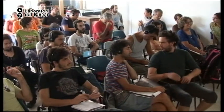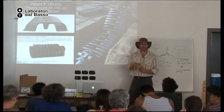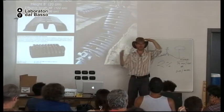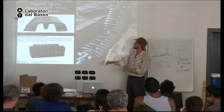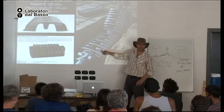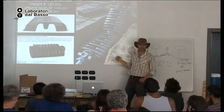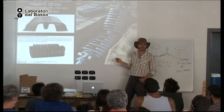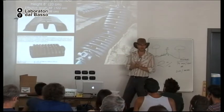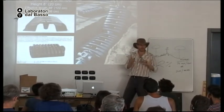The septic tank, I'll show you this system later, but the septic tank lets the solids drop out and the grease float to the top, and then the clearer liquids come out. And with a septic system, the clearer water that comes out would go into this. Okay? So you can use this with a septic. But I find with gray water systems, the septic is a problem because it lets the water sit and oftentimes turn into black water. But with a black water system, a septic can be good. But they're two different waters.